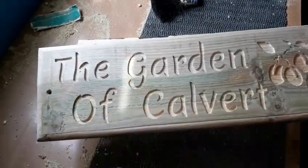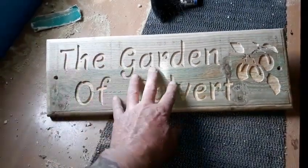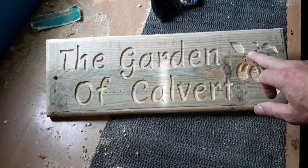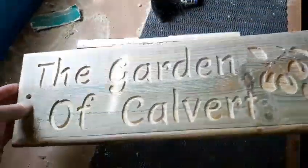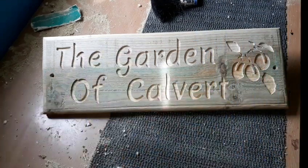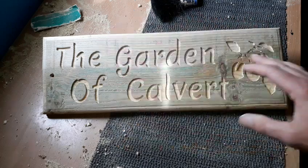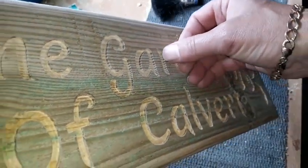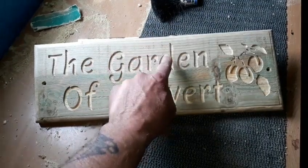We've cleaned up the best we can, gone inside, everything's still intact. Now it's time to put a bit of painting on. All the lettering will be done in black, we'll do a couple of bits of green on the three leaves, some kind of plum colour for the three plums, and a bit of brown in the branches. Just before we do that - with this wood being quite porous - it might just pay you to take a couple of seconds and spray some kind of sealant. Any kind of varnish or spray will seal it, and we're going to give it a quick coating over. All it's going to do is hopefully seal the pores of the fibres that we've cut into, and when we put our paint on it'll stop it bleeding into the side walls and making a mess of your straight lines.